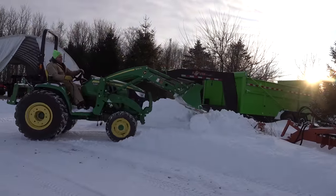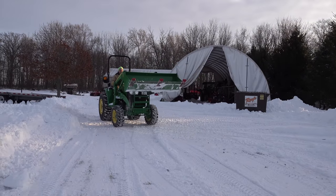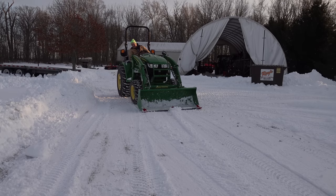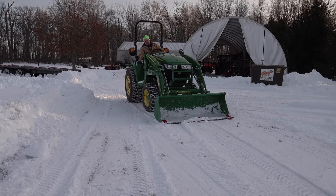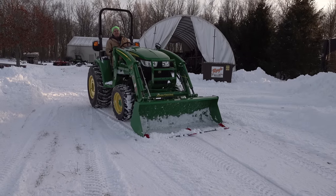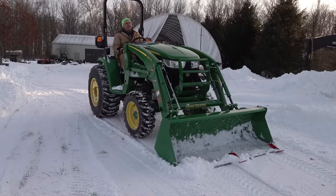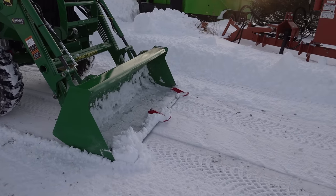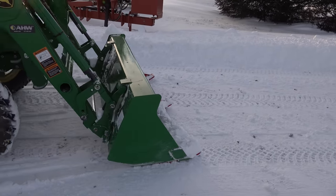It's kind of hard to see the edge tamers in action when they're working — they're usually covered over with snow. Let me make sure my bucket's empty and let me show them to you right out here on some snow. You notice I can even have the bucket tipped a little bit forward. I can't see my bucket, which is one of the problems — you can't see the edge of your bucket, even if you do have a bucket indicator. I'll even tip it forward further — I've got my front wheels totally off the ground and I'm not digging into the rocks. I find that just amazing. It doesn't work quite as well when there's not snow on the ground — it still works, but it does tend to push rocks up in front of the edge tamers in that case. When you have a little snow on the ground like this, they work fine. If I bring it back down to what I would consider the normal working position, they just work beautifully.